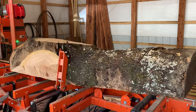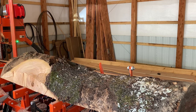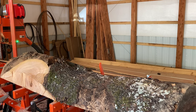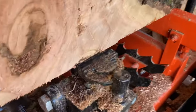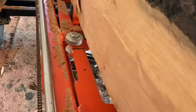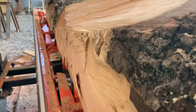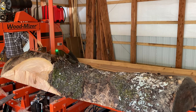In hindsight I should have stopped right there and cut just a little bit off of the width of this, but I was more focused on getting it turned over without flipping it over the top of those log stops. The log turner has done a pretty good job of turning it 90 degrees, but I'm using the log clamp to get underneath it and pull the bottom back toward the camera. I don't want that over-a-thousand-pound piece of material slamming down on the bed, so I've snuck the clamp back under there to slowly let it back down flush on the bed.